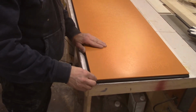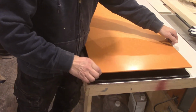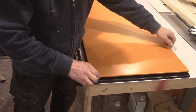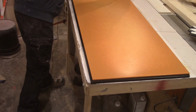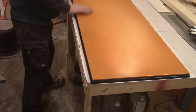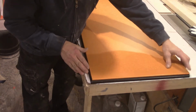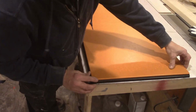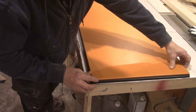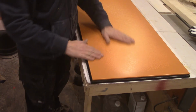So we're at the toe kick now, and I did the toe kick in two different pieces. I did this one, which is a 1/4, and I placed it right on top, and I put glue on there already. I didn't put a lot of glue on, I just wanted to help hold it. And then I will actually just screw it to the bottom of the cabinet. And I did two different colors, so it kind of matches a little bit better, it breaks it up a little bit, and it kind of gives a nicer look. So the top part is a 1/4 inch thick, and then the second part's 1/2 inch thick, and I routed the edge earlier before we painted, and that gives it kind of a more furniture look.